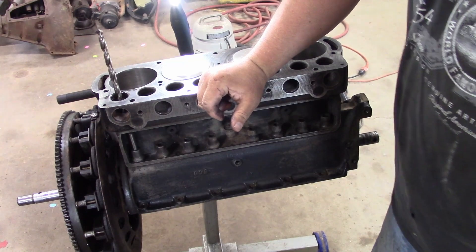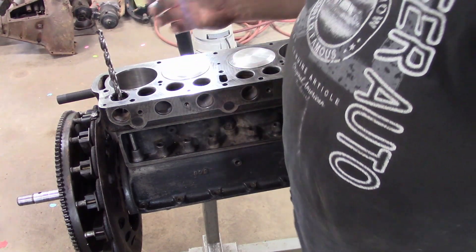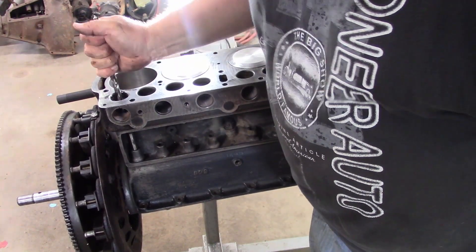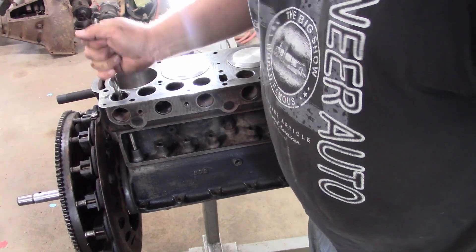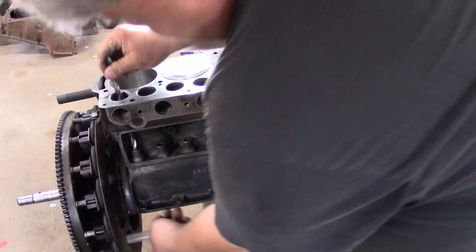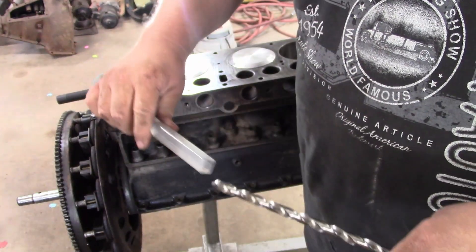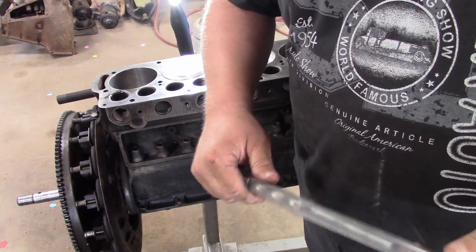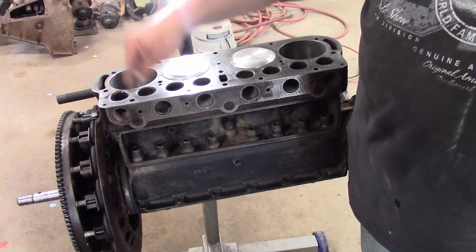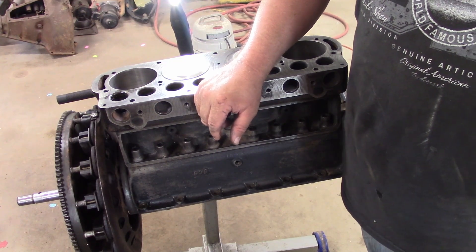Next thing to do is to ream this out or make sure it's smooth inside — it might be smooth enough. Sometimes a little rough gives a better fit, sometimes it makes it worse; it depends on the day. You can see it just goes right through. I think we've done that bushing part of it. I'll put this bit — it's never been used — back in its holder. Next I'll get set up, see if the hole needs to be cleaned up, and we'll machine down that guide material to see if we can get it pressed in there. Stay tuned, thanks for watching. Bye-bye.